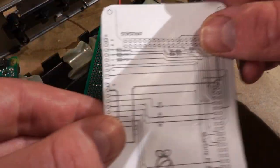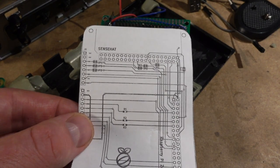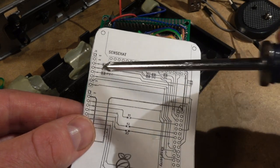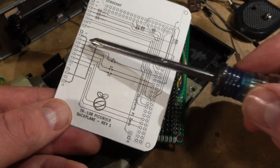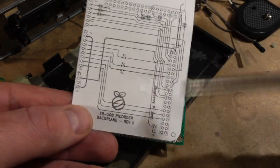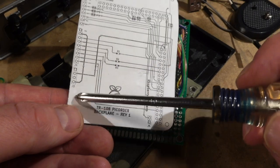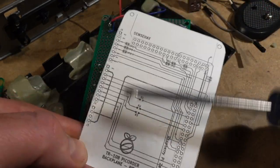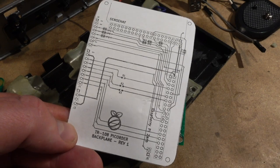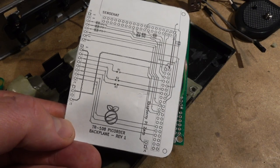So you can see in my new board, what I'm doing is I take them out and then I break them out into jumpers. Because I might be changing the screen out, I've decided to add support for an ST7735 SPI screen, as well as just the standard pinout that I was supporting anyways, and a new power header. So basically I'm trying to break everything out to this edge and then also leave some open-ended stuff. I'm going to put an I2C connection here and maybe a SPI connection here, or move it all down and do the opposite. Anyways, it'll be a general purpose board. It won't be exactly for this application of a Picorder. It could be for any kind of TOS or any kind of large scale tricorder like this, maybe even like a disco tricorder or something if you're so inclined.